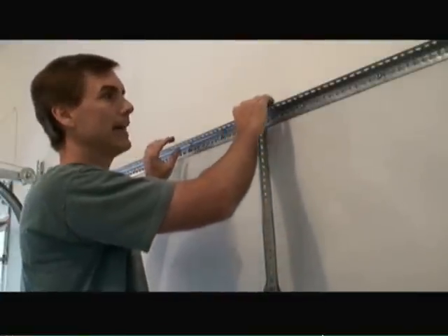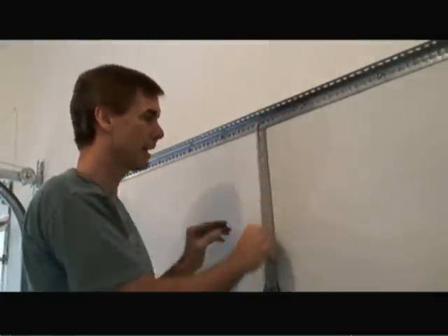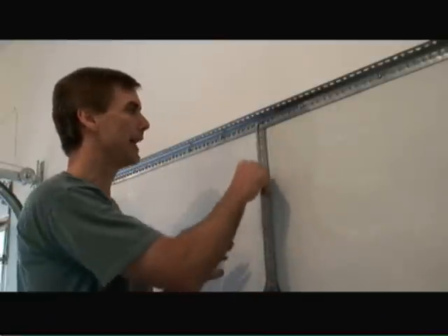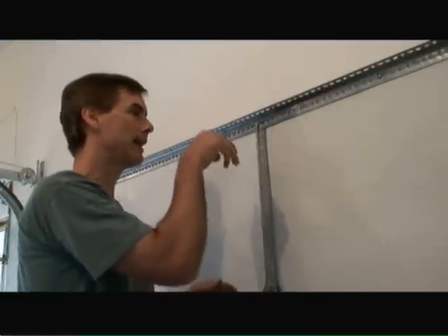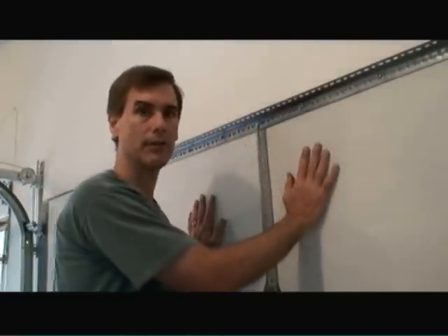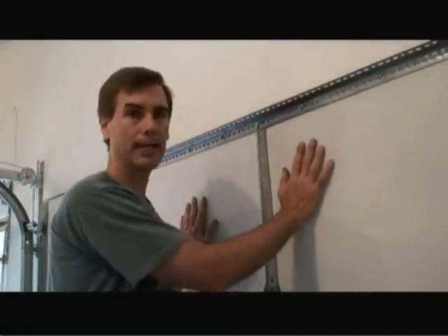The first thing I've done is attached a length of angle steel across the top and along the upper section of the garage door to act as reinforcement steel and to allow the garage door opener to pull on the reinforcement steel versus the garage door itself. This will protect the garage door from getting damaged.